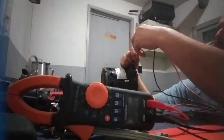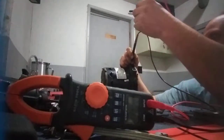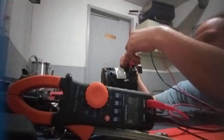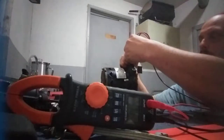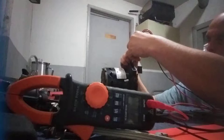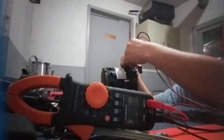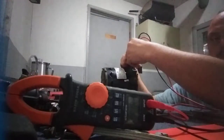Hello YouTube viewers. Today I'm going to be testing a furnace blower motor and bench testing it to make sure it works. One way to do that is to start one contact on the white and then go through all the different terminals and test the resistance value.